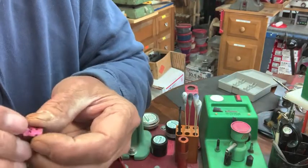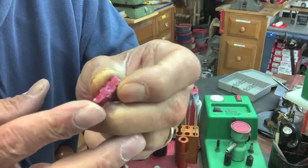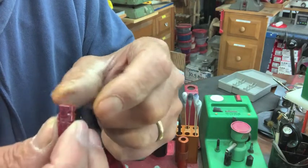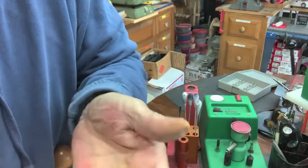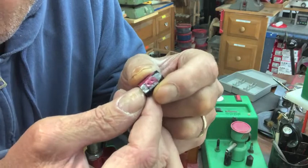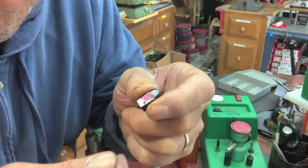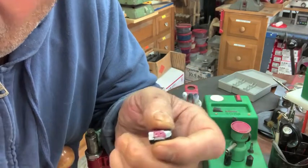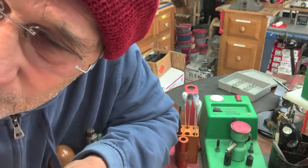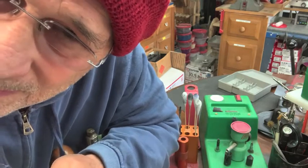There's a 357 38 type slug that I've put a test on, and the diameter of this is different from, say, one that I'm testing that's, say, the 45. So that means I've had to use different strokes to bring that plunger up flush with the top of that spring-loaded dimple die. And that's part of something that I have always hated.